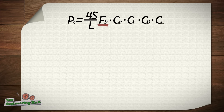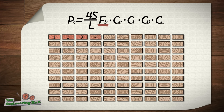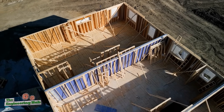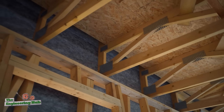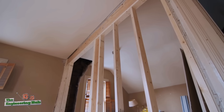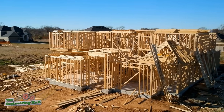Let us go back to the capacity equation and revisit the strength factor. As I said earlier, this is the 5th percentile strength, which means that if I test 100 2x4s, the 5th weakest board should fail at the code-rated loading. In other words, the values predicted by the codes are meant for the most hideous piece of wood — some of the worst 2x4s you could find, or in mathematical terms, the 5th percentile. So practically, we design the whole structure based on the strength of the weakest link. You may argue that it's inefficient to design structures for the weakest link, since 2x4s never act alone — they are almost always in a structural system such as a stud wall or floor where they act together as a unit, so even if one is weak, the rest will pick up the slack. This is a fair critique and one that the code takes into consideration.